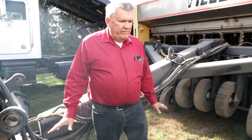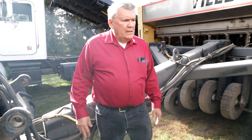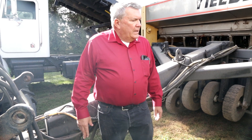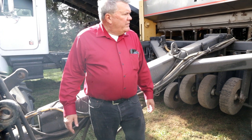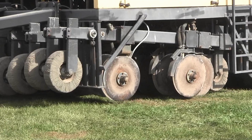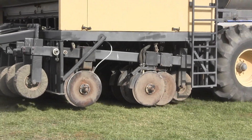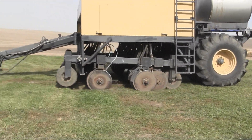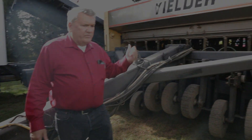It's a high-watermark machine, circa the 80s — tough to duplicate even yet today in 2017, this is still the highest-yielding design available. It's only 15 feet wide, and that's some of the reason it yields up. The widest we ever built was 25-footers and some at 28 feet; we also tandemed up a few drills into 40-footers up in Alberta. It was a massive effort at the time because everybody was very doubtful about no-till, but as we began to discover we could actually drive yields higher, a lot of farmers gave up on conventional farming because of this machine. Very simple, straightforward machine.